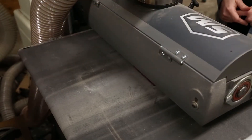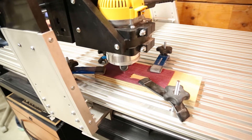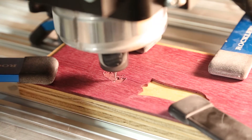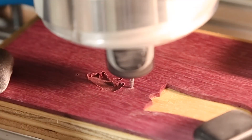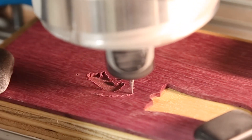Next, it's on to the CNC machine. I secure the workpiece with clamps onto a simple spoil board. Once the tiny end mill is in position, we can start the cut. The pocket and oval shape will take about 10 minutes. I program tiny tabs that will hold the piece down so it won't fly off the table.